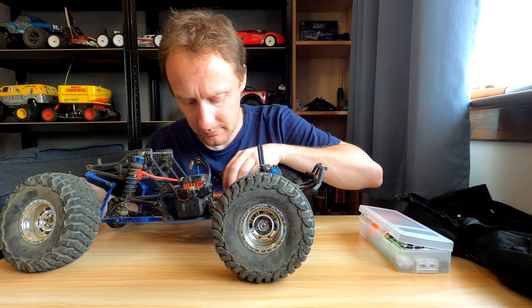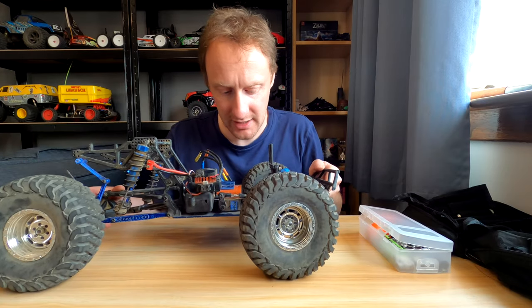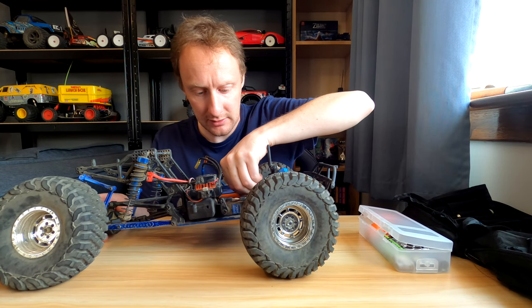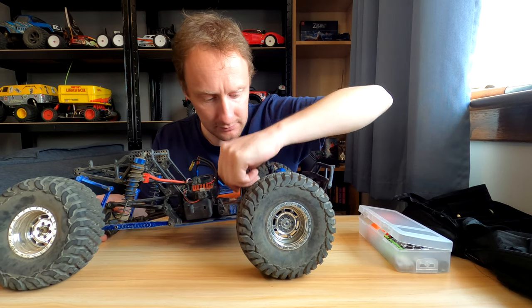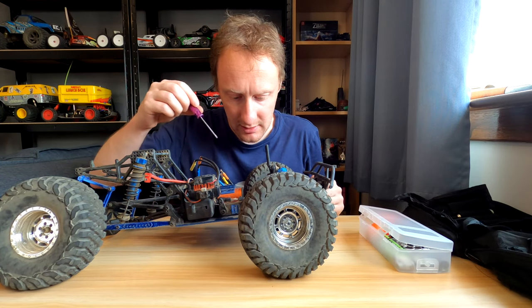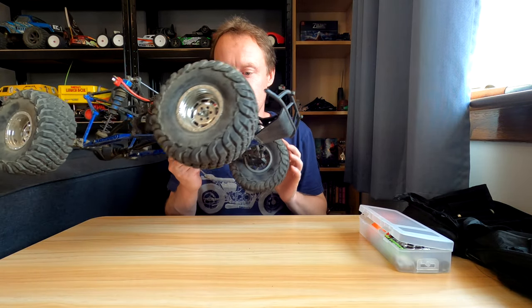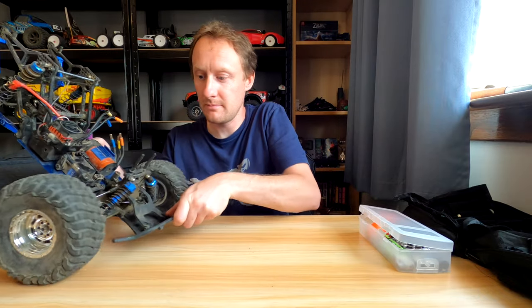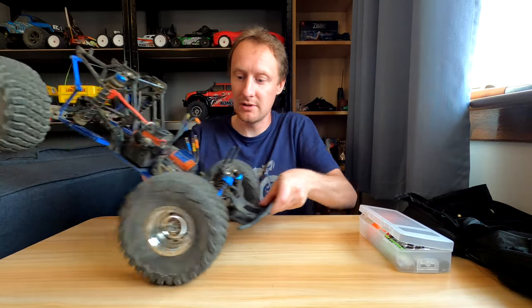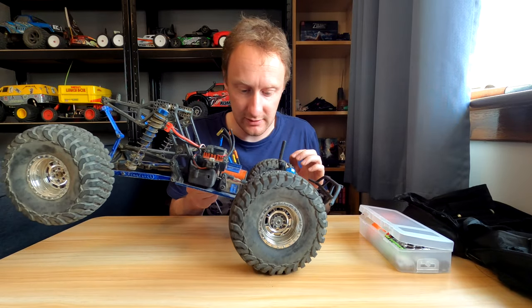But I could easily fix it now, but I want to be able to show off what's happened. And to do that, I'll need to just remove it all. So let's have a look. Can you see the state of... I see, look. Let's have a look. It's now free. So that's exactly what it was. That grub screw has come loose and is smacking into the motor.